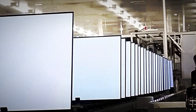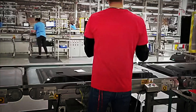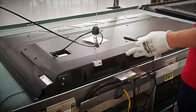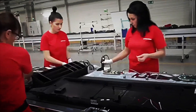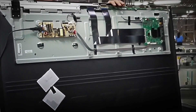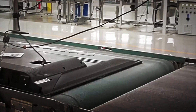The plastic used by Samsung is lightweight, yet highly resistant, with additives that make it fire-retardant and durable. The molds are designed for each specific model and size, from 32-inch televisions to giant 85-inch screens. Once the parts are removed from the mold, they pass through an automated cooling and polishing line, where burrs are removed and a scratch-resistant coating is applied. Then, the panels, circuits, and housings are assembled with extreme precision, ensuring a perfect fit between the parts.